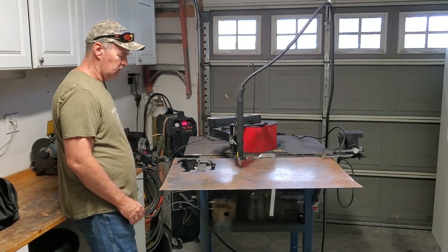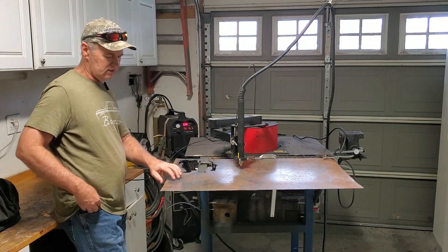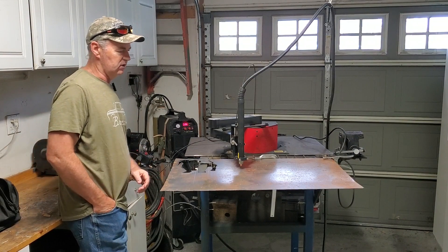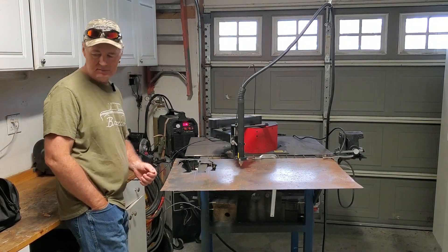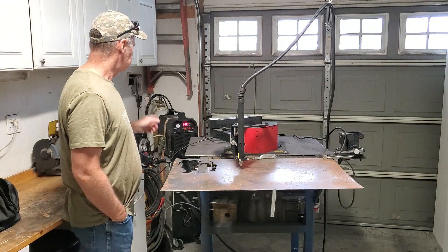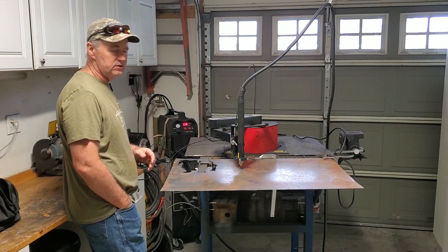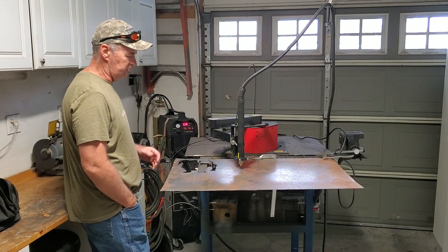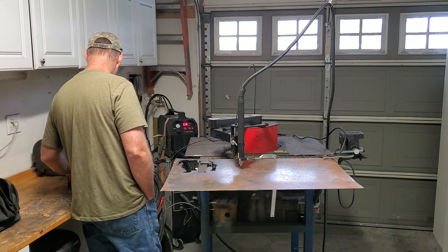The tree's all loaded and ready to cut. 26 amps on the plasma cutter. This is that sheet of metal that I got — I didn't measure the exact gauge of it, I believe it's a little bit thinner than 16 gauge — so I dropped it to 26 amps and increased the feed rate to 120. Hopefully that's not too fast, but let's see what happens when we run it.